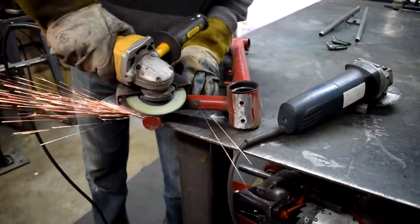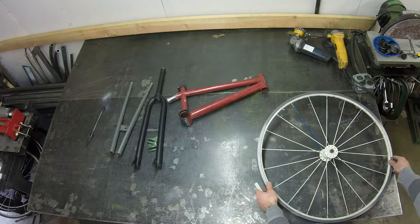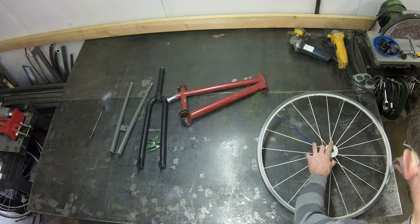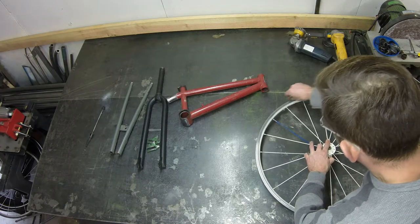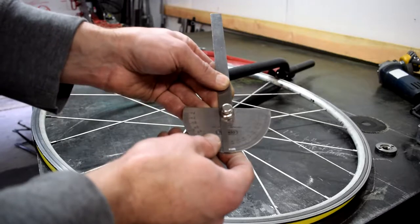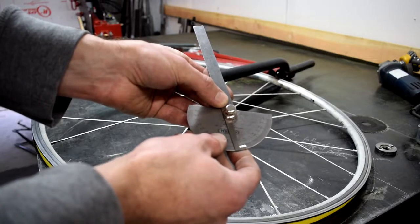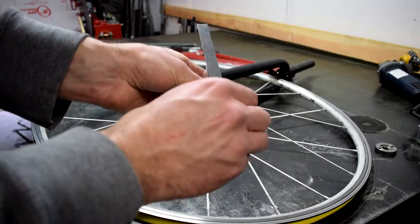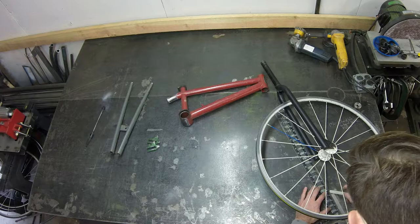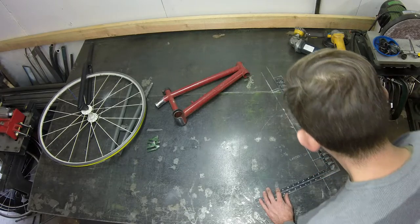Just do a little bit of cleanup of the frame — get rid of all the excess metal and paint. For a lot of freak bike builds, I love just using my fabrication table. Get the axle position marked out and just to help me visualize, trace the outside of the wheel too. Using an angle finder, I'll mark the angle of the head tube. Before I cut everything up, this bike used a 68-degree head tube, so I can set this to that and then transfer it over to the table. I do a lot of the mock-up using the straight edge of the front of the table — use the angle on the edge, transfer the line using a square, and mark some of the key points on the fork.